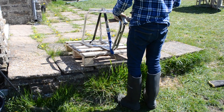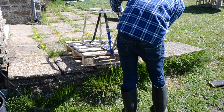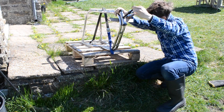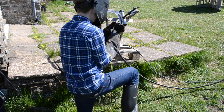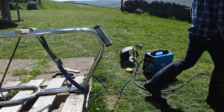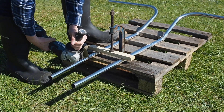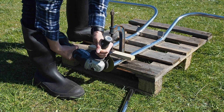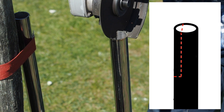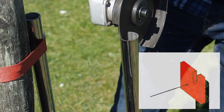So I've just welded up the forks so they're nice and sturdy, and now I'm welding the pivot point to the frame. Because this is a cylinder with ball bearings, grease, and lots of moving parts inside, what I'm going to do is weld it in lots of little bursts. Therefore, it's not going to get too hot and warp the cylinder. And now I've done that, and it fits all nicely, let's cut the forks down. What I'm doing here is cutting down this tube so the plate that holds the wheel shaft can slot in nicely and also give it a bit more strength, as well as looking better. So now we just need to cut out them plates, which I'm using a grinder for, and that'll cut the slot out to fit around the wheel shaft.